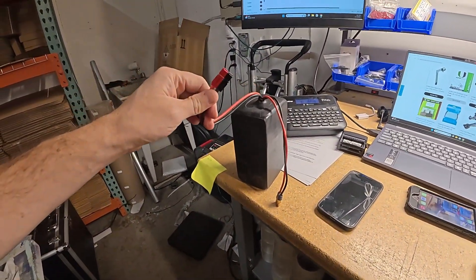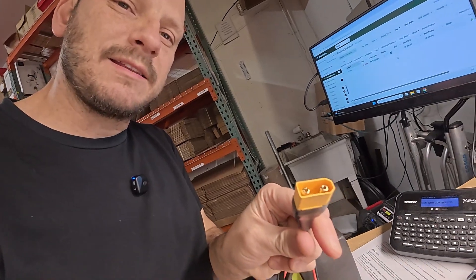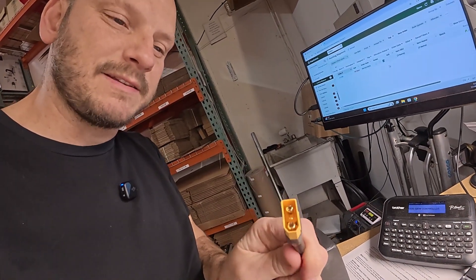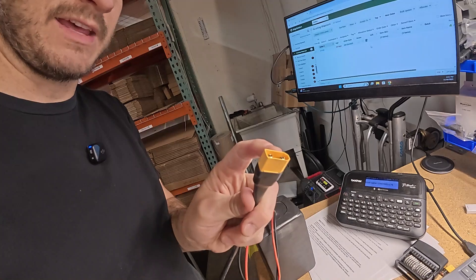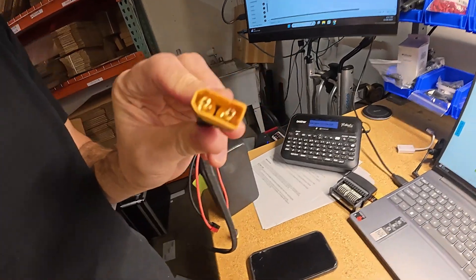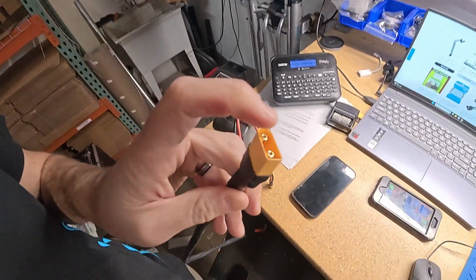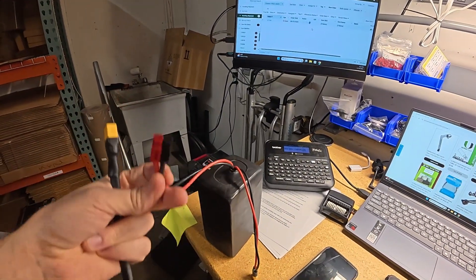If you have a battery like this, the best thing to do is don't unplug and replug it all the time. If you can leave it plugged in, that's best. Another terminal you may have is the XT90 — especially for 72-volt systems, this is a step up, rated for up to 90 amps. The XT90S is a spark-resistant version with a little green dot, usually on the female end. It's a little better, but you can still get sparks and pit those connectors out.